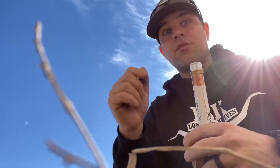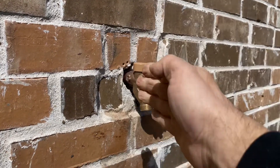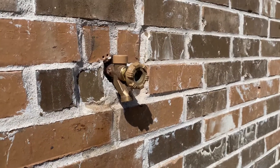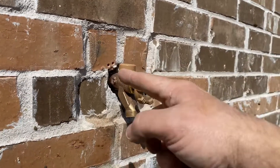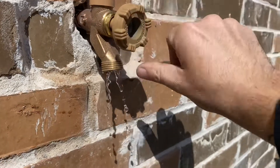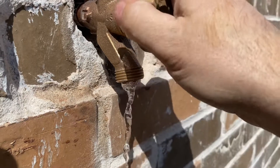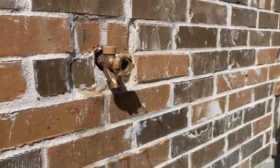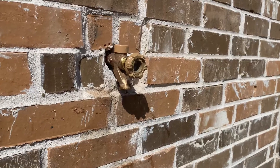Let me get this thing threaded in there. Got it on there, threaded it in, got it to where it was tight. You can see it dripping — I've turned it on already to make sure it works and it's not leaking inside, which it is not. A good tip for making sure it's actually working correctly and not leaking: you just barely turn it on, put your thumb over it, and then the pressure just shoots it out like that. That's how you know it's good. If you've got a busted pipe or a leak in there, it should force out that way.